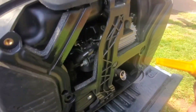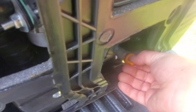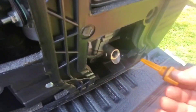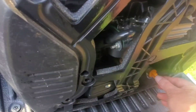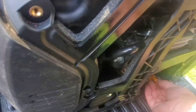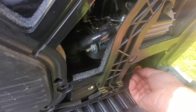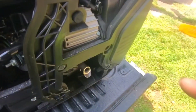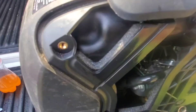So it gives you quite a range of oil level. We're gonna assume it's probably like a Honda where you check it by pushing it in but not screwing it in — just push it in so it's flush and then pull it back out. And if that's the case, the oil is really, really low. I didn't actually get any on the dipstick. Let's screw it in and see if we have any oil on the dipstick that way. Still no oil. I bet our problem is the low oil cut off in this.